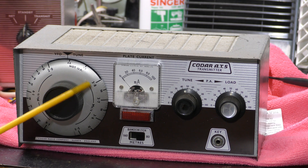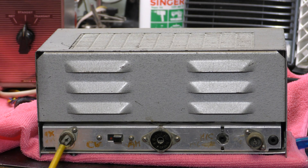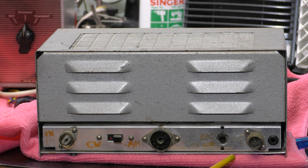Notice it's marked here — not UK — for the top part of 80 metres, of course. Here's the rear of the transmitter. There's the RF output, a switch for AM or CW when using it for Morse, and the 11-pin connector again. There's a very strange potentiometer — a very strange fitting — which is used to adjust the modulation level, and that's the microphone input. This is designed for a crystal microphone, so hopefully something from my tape recorder microphone stash might be suitable.